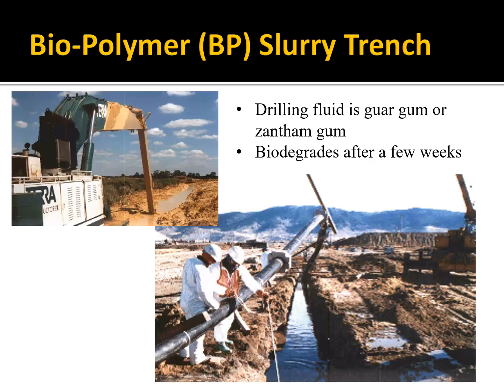In some cases, they'll even put high-density polyethylene in interlocking sheets down inside this trench, but typically they backfill it with the low permeability clay. But so that's a way you create an impermeable trench. What if you want to make a trench that is permeable?